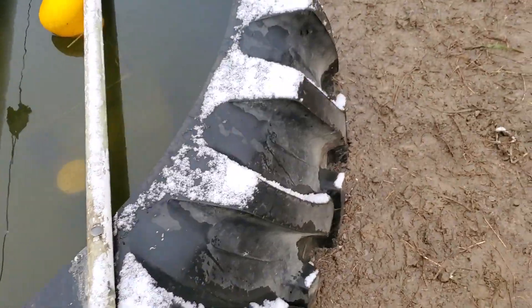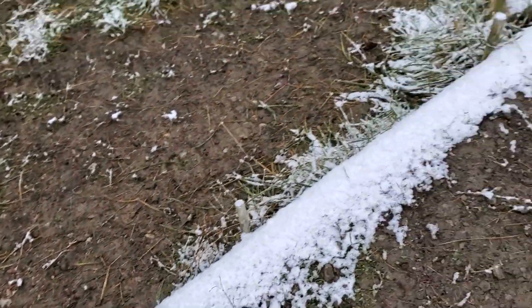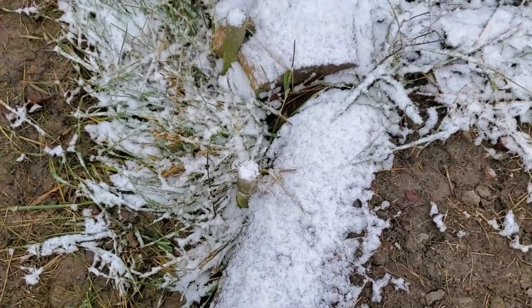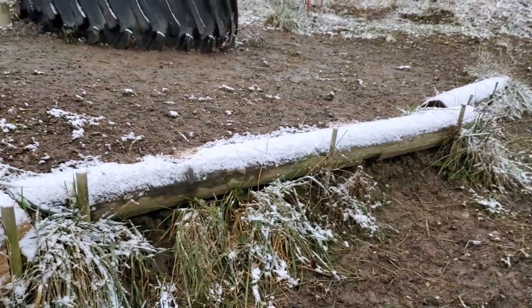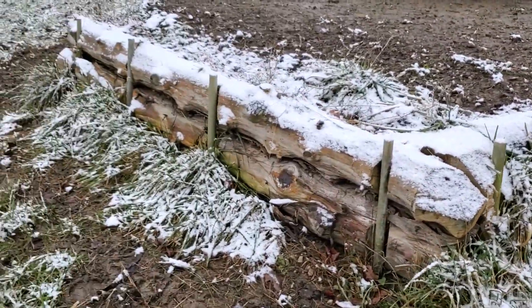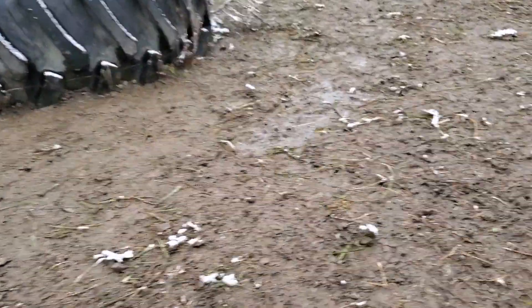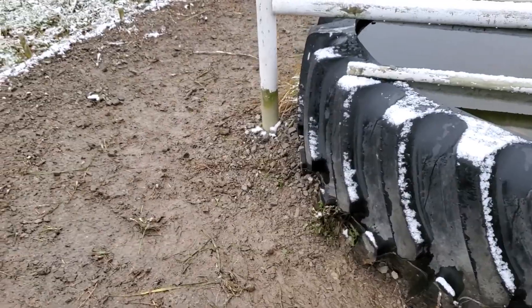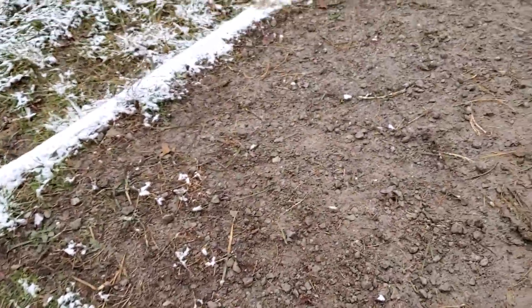This one's an 800-gallon tank, and I've got it up here on a nice pad. Here's my landscaping timbers — that's cedar that we cut off the farm. We've got it staked in there with an inch and a half fiberglass. It's up there about three feet. It's got 16 tons of rock on there, and it's got a piece of geotextile on the very bottom, which is a polyethylene mat. Don't ever put a pad in and leave off the textile — that's the biggest mistake you can make. This textile keeps the rock from settling into the dirt.